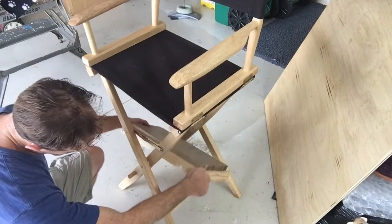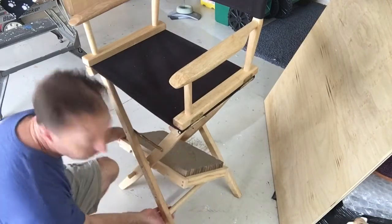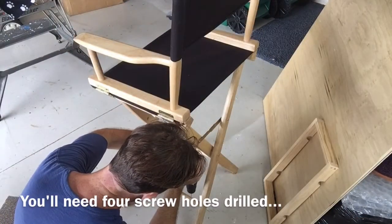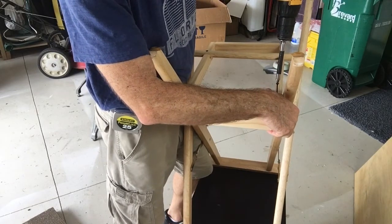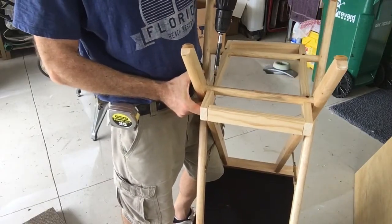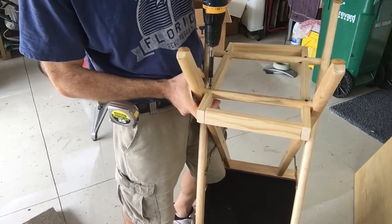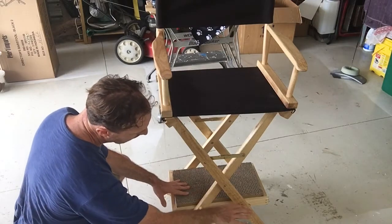As you can see, we've got the cutouts for the rungs and it fits right in there. I pre-drilled four holes into the rungs and up into my pine so this is fixed in place and feels more stable. I'm using inch-and-a-quarter screws to go into the bottom rung and into my frame. This will be removable because the chair folds up. There — nice and snug. Now we can move on to the next step: the footrest.